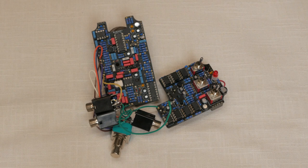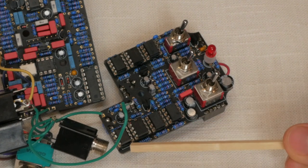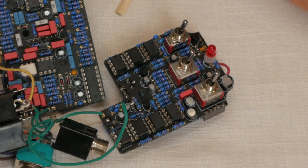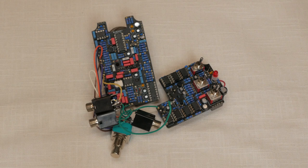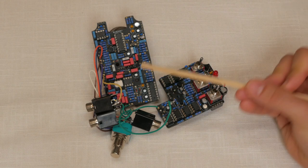Let's look at the Bucket Brigade device and clocks. The original Dimension C used MN3207 and MN3102 BBDs and clocks. I couldn't find these anywhere. I used Cool Audio V3207 and V3102s from Small Bear for my build. They sound good to me. I sprung the extra 10 bucks for the OPA2134 op amps instead of the TL072s as suggested by the guide.